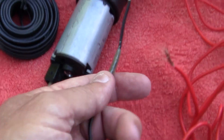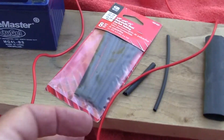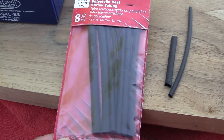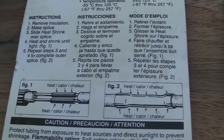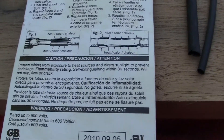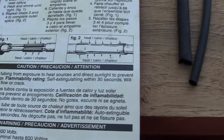Then what he suggested is I get rid of these Teflon — or whatever they are — insulators used for speakers, and use shrink tubing instead. If you've never used that, it's really good for this. You put it over your wire — it's a lot larger — and then where you put it over the wire you want to insulate, use either a heat gun, a hair dryer, or your solder gun. If you go over it very lightly, it will shrink to fit the wrapping.